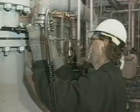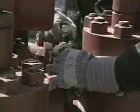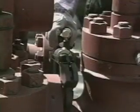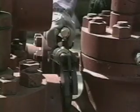The superior characteristics of a bolted joint are only present if all bolts are correctly loaded. Achieving a specified bolt load depends on several variables, such as thread condition, bolt length, lubricant used, and use of washers, to name just a few.